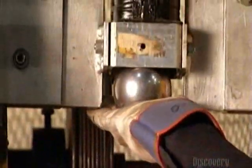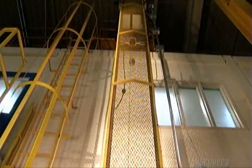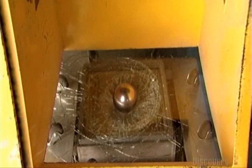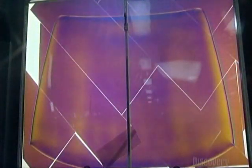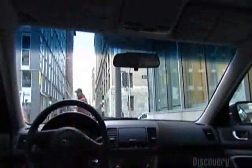Now they place a two-and-a-quarter kilogram steel ball into a pulley system that raises it four meters high. This is a crash test for a sample windshield — the ball represents a driver's head. The ball hits the glass but doesn't go through, which means the windshield has passed this safety test. They then view the windshield through polarized light, which reveals stress defects, but only a trained eye can spot them. Once it's decided that everything looks good, the windshield is ready for the road — and the view from the driver's seat is now as clear as glass.